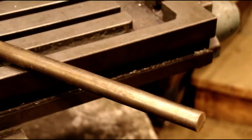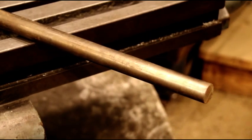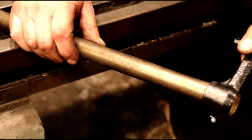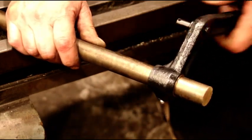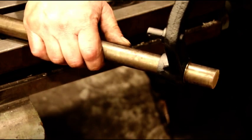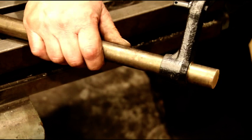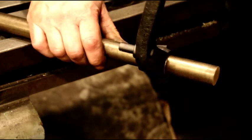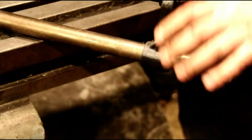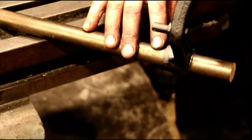We're going to try it on the shaft. Here is a piece of one inch 4140 material that I'm going to use for my brake and clutch shaft. Let's see how this fits. There it is - you can see there is literally no movement. I mean, just enough. If it was any tighter it wouldn't move. That's just a perfect amount of play - not moving a half or quarter inch either way - just a tiny little bit. We have a perfect one inch bushing on a one inch 4140 shaft.